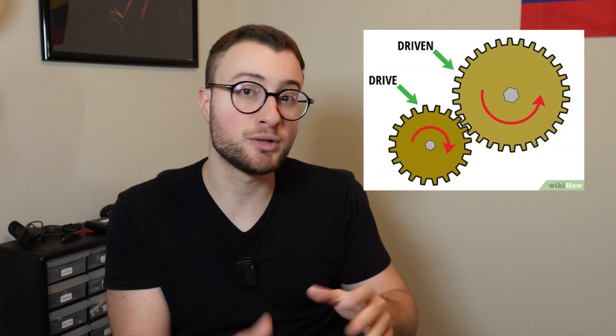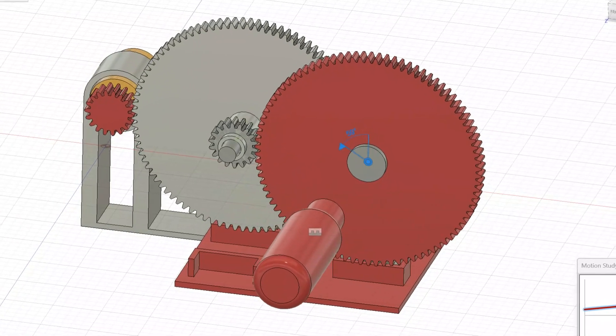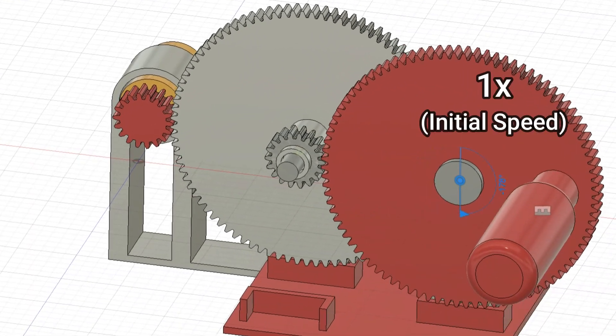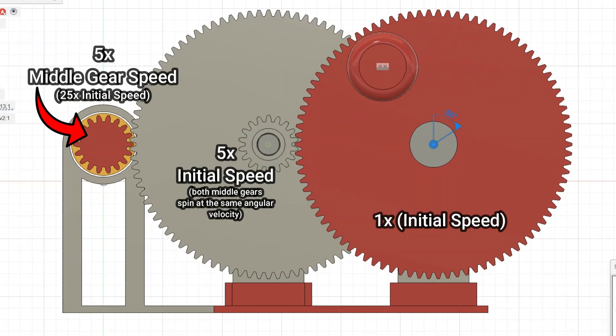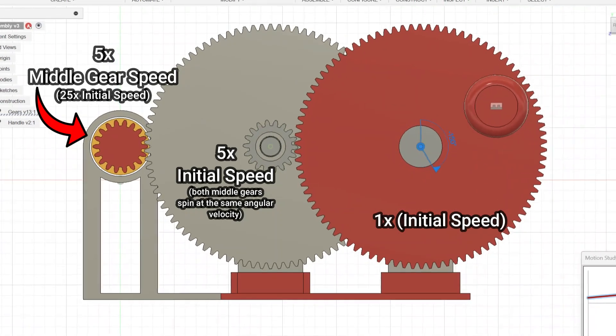Just by stacking a few gears together we can multiply output torque or, in our case, output speed. I designed a really cool system that does this and here's how it works: we have a large gear with a handle which we'll use to spin the system — it has 5 times the teeth of the smaller gear, meaning that for each full turn of the large gear the small one will spin 5 times. If we turn the large one at 1 revolution per second then the small one will spin at 5 revolutions per second. Since the small gear is fused to another large gear that's 5 times bigger and the motor is connected to the smaller gear, we multiply the speed again by 5 — so overall the motor spins 25 times faster than the initial gear.